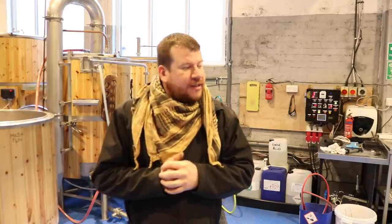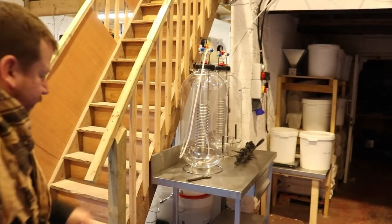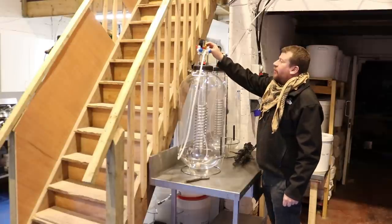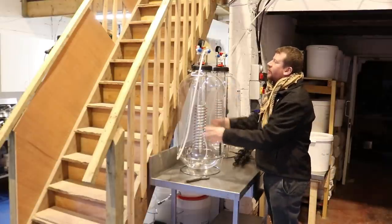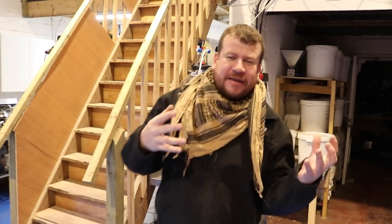But there are lots of other things for me to be getting on with. So I think what I might do while I'm here waiting is get out an undercounter chiller for this lot. If we can pop an undercounter chiller down here, then we can keep these two cool. That one's lost its pressure overnight, but I did have the blow tie open slightly. It's still got 5 psi in there or so. Hear the difference? This one's still got its 10. I don't think I screwed the lid down properly either. But anyway, let's get the chiller out. Let's set some STCs up. That's important. And then let's get some glycol in it and see if we can get it going.